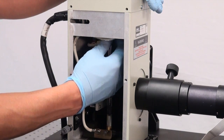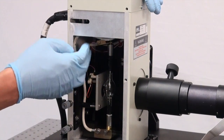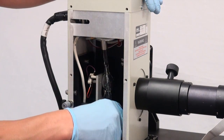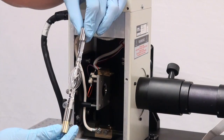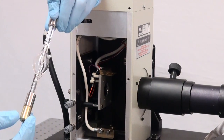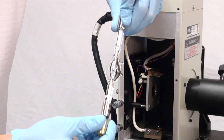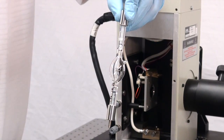We're actually going to completely remove this screw. Then we're going to remove the sensor block from the top portion of the lamp. Now we've just removed our xenon lamp and we're getting ready to replace it. This is the socket adapter — it's attached to the bottom end of the lamp and it should unscrew simply and very easily. Now you've just uninstalled your xenon lamp and you're ready to replace it with a new one.